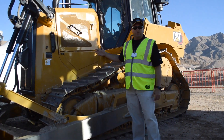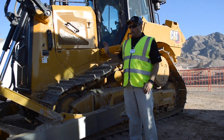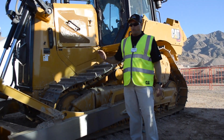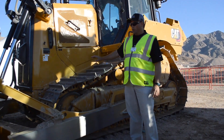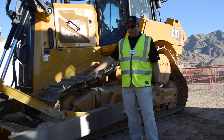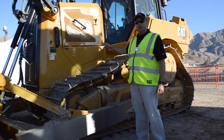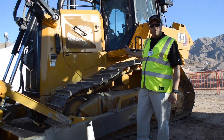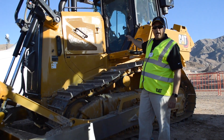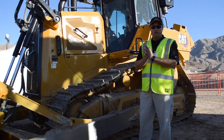The D6 is the replacement for the D6T size of dozers. Very similar in terms of weight and horsepower, but don't let me kid you — these things are all brand new from tip to tail. New frames, new roller frames, new undercarriages, new blades and push arms, new engine, cooling system, hydraulic system, electronics. This particular dozer has a brand new hydraulic winch on the back of it as well, and of course brand new cabs, brand new brake control systems — all the kit inside this tractor is new.